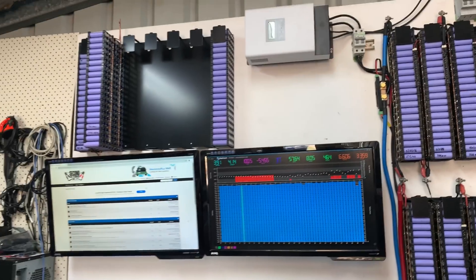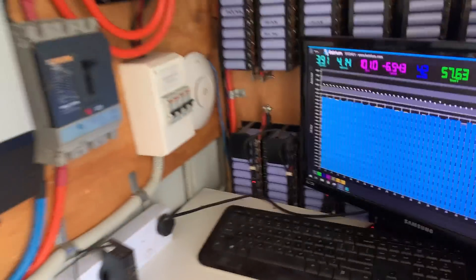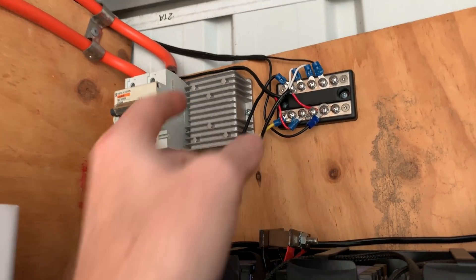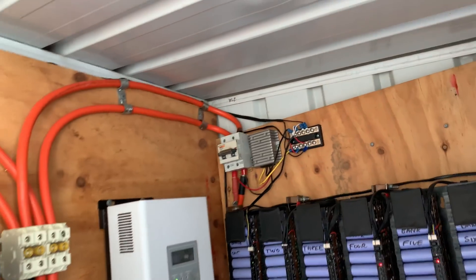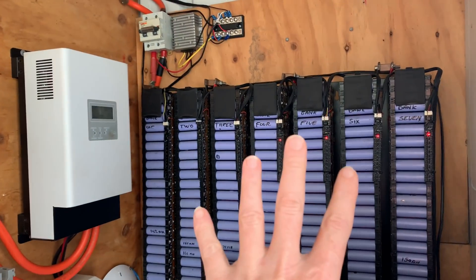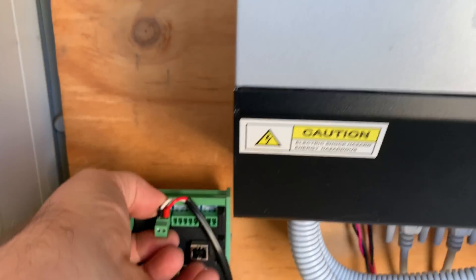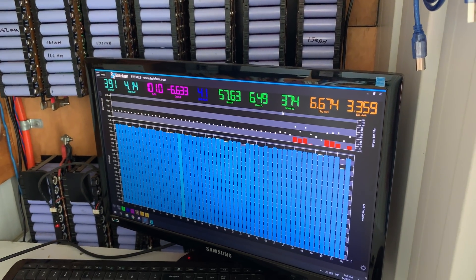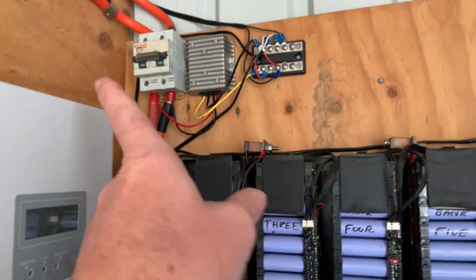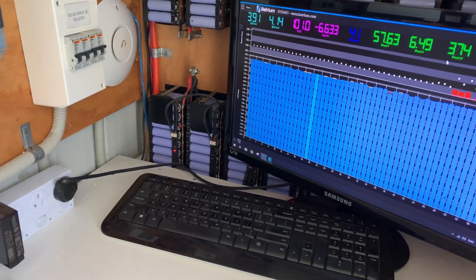To replace this one I already have another pack built, I just have to attach the bus bar. This is one of my early packs so it's got the flat bus bar, not the twisted copper. I just have to make that up and put it back into service — we're not going to notice 10 kilowatt hours missing this time of year. Down in the battery shed, cell number 55 is right here. I run my Batrium through the step down, which wastes energy — I'll be changing that shortly.